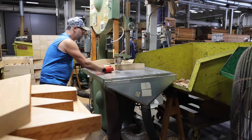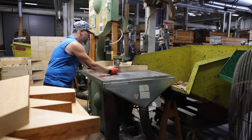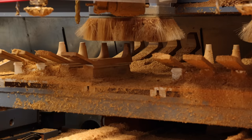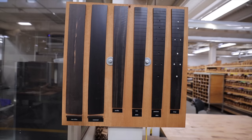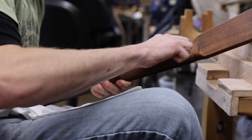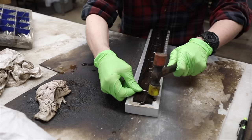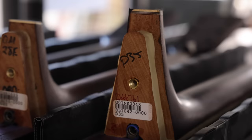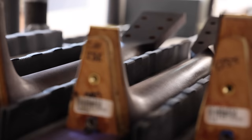Each neck is shaped before it goes on the CNC — it's done on a bandsaw by hand, marked out with a pencil and a template. Makers then use a computer-operated router to finish carving out the neck and the fretboard. The fretboard is made of hard-wearing ebony and precisely lined with the frets. Nowadays all of the necks will go through some sort of CNC cutting process but they also all get finished by hand, so every neck is a little bit different. Narrow slots are cut into the fretboard, then fret wire is placed in each of the grooves and a machine secures them in place at the correct height. The neck and fretboard are glued together then sanded and polished. A steel truss rod helps keep the neck perfectly straight, counteracting any stress from taut strings or humidity.